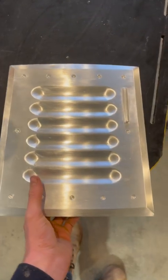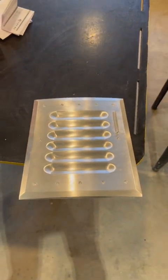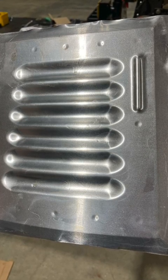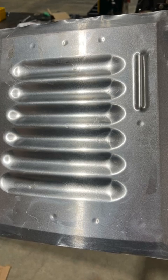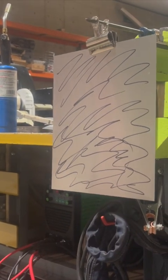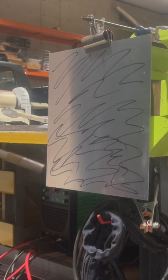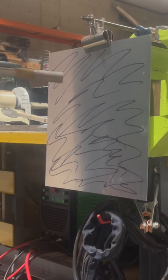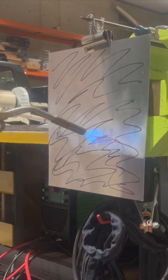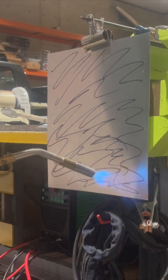This was the small one I started with, and here's where I got — I mean, this is dead on. If you look at pictures in museums of this panel, it looks just like this. At this point I was ready to go ahead. The way I made these panels was with my 50-ton press and I annealed them. If you scratch Sharpie all over a piece of aluminum and go over it with a blowtorch, eventually that Sharpie will disappear before the aluminum hits its melting point. I learned the hard way that a king-size Sharpie uses different ink — you will melt your aluminum trying to burn that off.